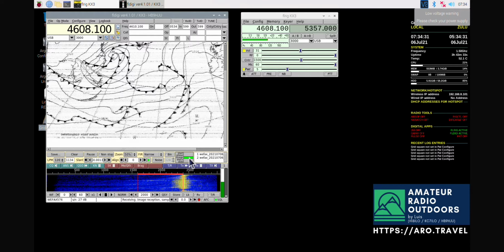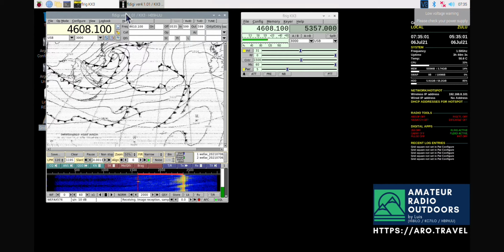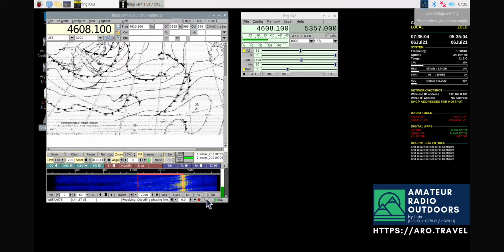Once you have that, next step is going to be moving your squelch to a really low level, making sure that you have selected in your operational mode in here, in WeFax, you go ahead and select WeFax IOC 576. This option is very important because most weather fax transmissions are in that format, 576. Once you've done that, make sure to disable automatic frequency control.